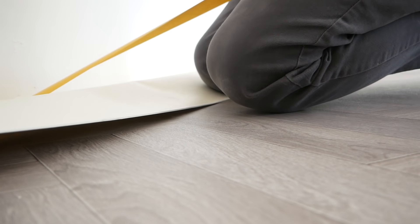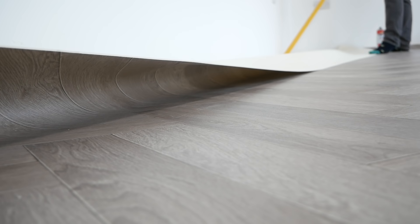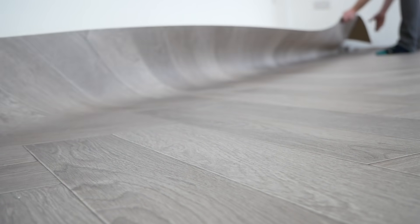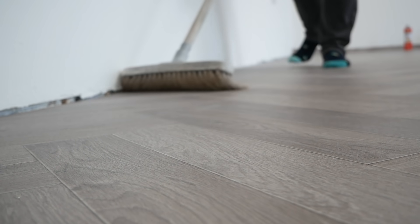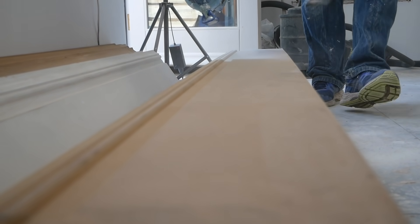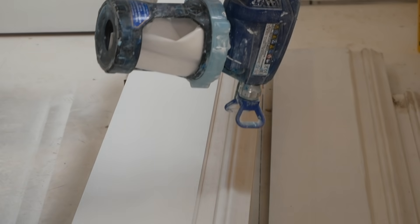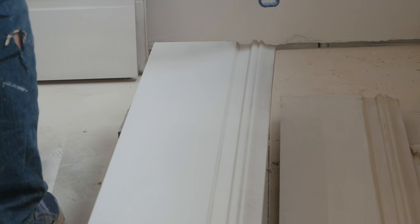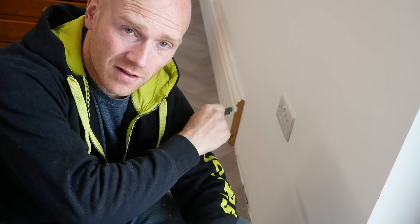Now the room is four by five meters — actually a little bit over — so I needed my skirting board to make up the difference. We're only about 10mm short each side, but I decided to go down with the vinyl first and then sit our skirting boards on top of it. We've already got the skirting boards — we bought them from a house clearance when we first moved in here, so they've been kicking around for about seven or eight years. They're just MDF but they're nice and thick, 10 or 11 inches tall, quite substantial with a nice moulding. There are quite a few corners, joins, miters and scribes to do.